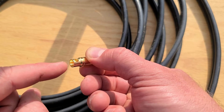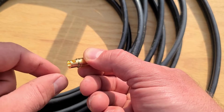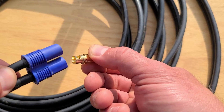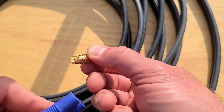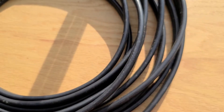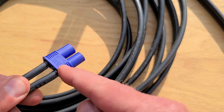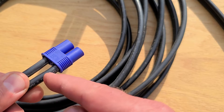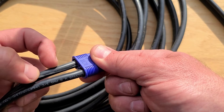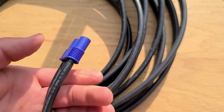So it doesn't look like there's any solder on the wires as it leaves this connector. That's the weakest point — right where the wires go from having just the copper strands with no solder to being soldered inside. When you pull the connectors in and out and wiggle them — I try not to pull on the wire itself but they're hard to get out — that's the weak point. I replaced the other end already today and I pre-tinned the wires, so some of the solder goes up and underneath the jacket, making it stiff back up in here.